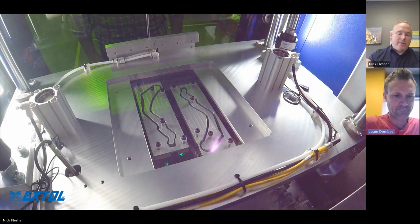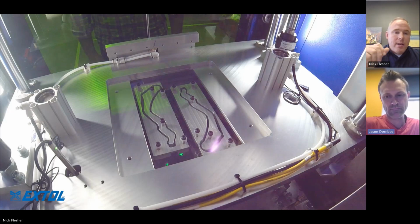You'll notice that as the laser we used a different filter. The 1 micron wavelength, which is what we're using here, is invisible to the human eye. So you can only see that through the camera that we're using to showcase that. It's moving really quickly, so it looks kind of intermittent, but the camera is just not picking up on it. We're moving like 3,000 millimeters per second in this particular application.